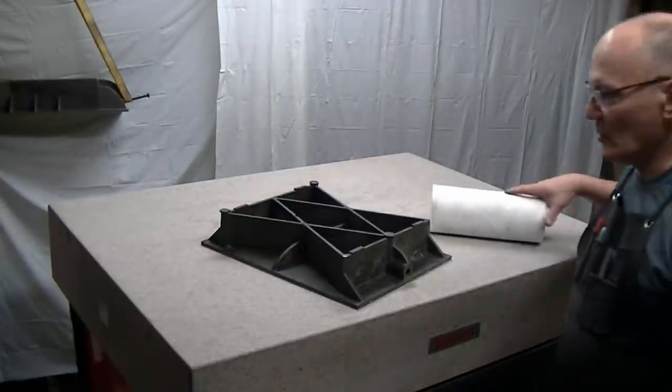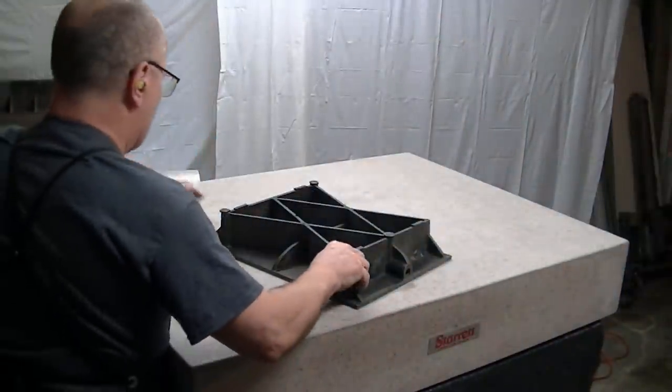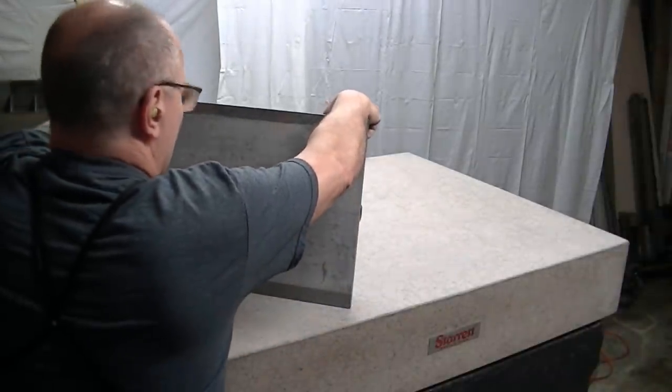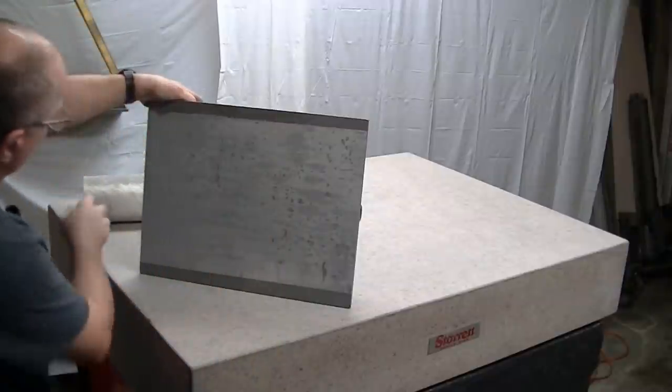Let's take a look at the lap before we go too far and see what kind of condition we've got going on here. Here's a look at the plate. I think these parts are where it's puffy and the aluminum's actually floating up and down. But it's cutting beautiful. It feels really smooth, and we're really removing material and the charge is staying put. The iron plate seemed like one lap and I was losing the charge and I just started to rub iron on. Well, I don't know what I'm going to see when I measure here, but I'm really impressed.